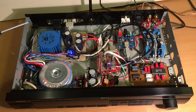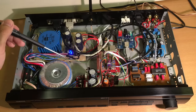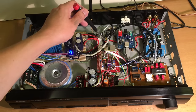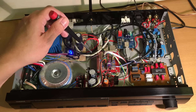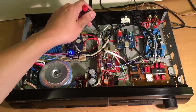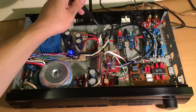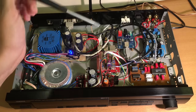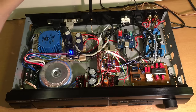After 10 seconds, the power is also cut and then the standby consumption is less than 0.1 watt. There is also an external USB, external HDMI, and since this is a Raspberry Pi 2 which does not come with integrated Wi-Fi, there is a little USB Wi-Fi module with the possibility to connect an external antenna — which we do here, and which is also a good idea because it's a metal case and we need the external antenna.